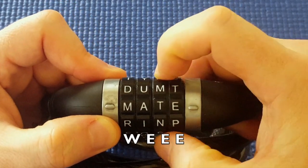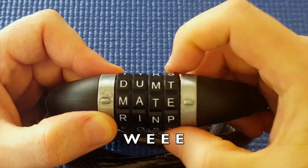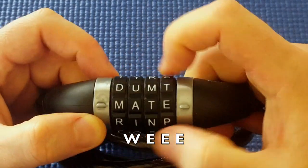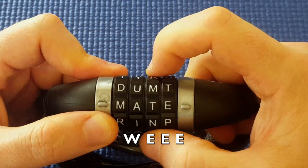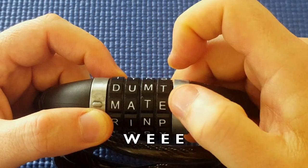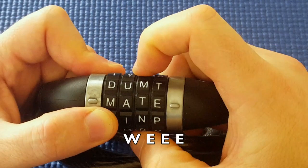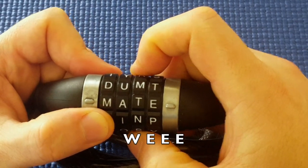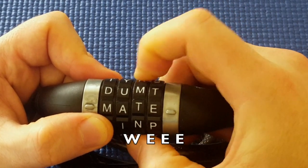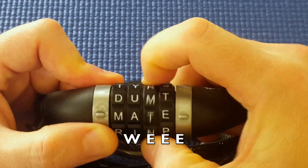Okay, let me go to the next wheel. I found that the binding order — this wheel seemed tightest, then this wheel, then this wheel, then this wheel — so that's what I'm doing in this order. Now I'm going to turn the second wheel. If I have E correct, the second wheel — I will find some letters that will get stuck quite tight. If E is wrong, I won't find that; the wheel might just turn freely or just get stuck a little bit. So let's give it a go.